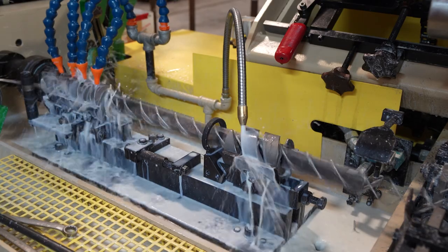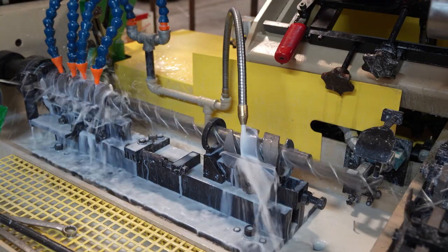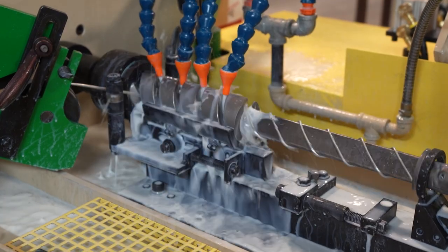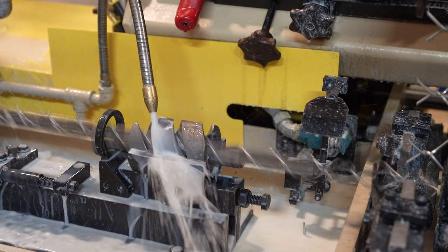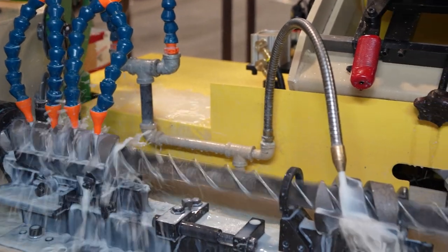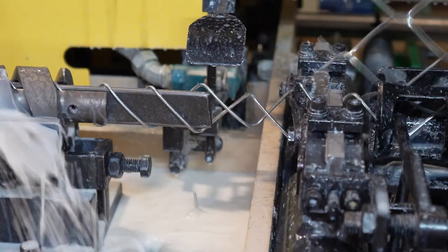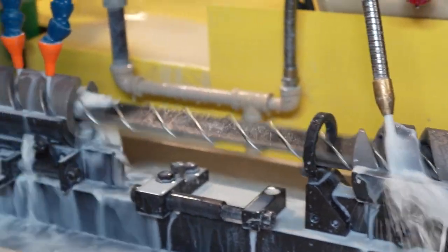What you see here is the inner workings of this machine: a cylinder-type worm drive around a rectangular tooling that gives the diamond its shape. The worm drive establishes how wide those diamonds are, and the rectangular tooling gives the wire its shape. It's weaving two pickets at the same time. You can tell why the cover is on this machine because it makes quite the mess. The machine really wasn't working at full force either — it could be tuned up to go faster, but the faster it runs, the more misweaves and mistakes it could make. Brenton seems to have found a sweet spot.